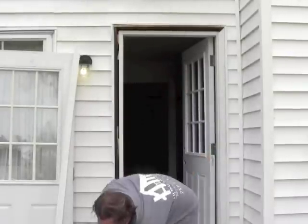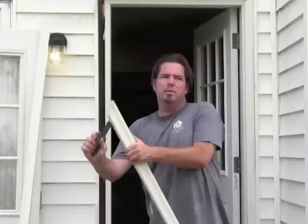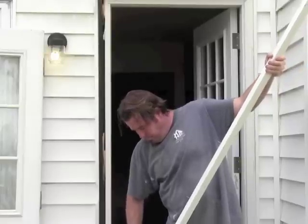Next we're going to take our side cutters. They clip nails flush. And we're just going to clip all the little nails that are on the trim. Also going to do this piece, so it'll be ready to go back up.